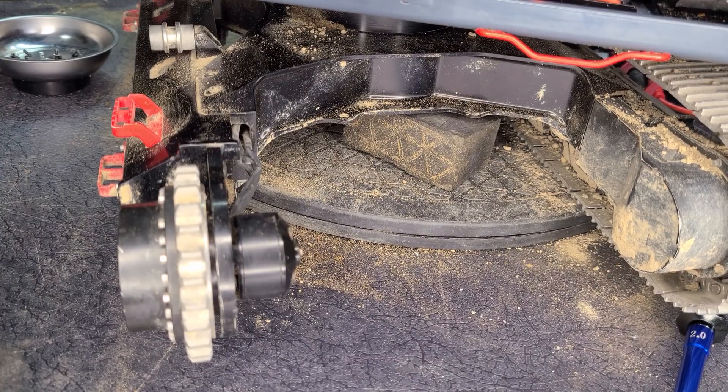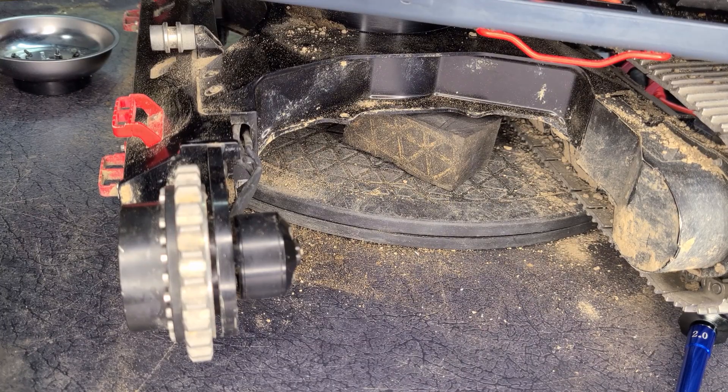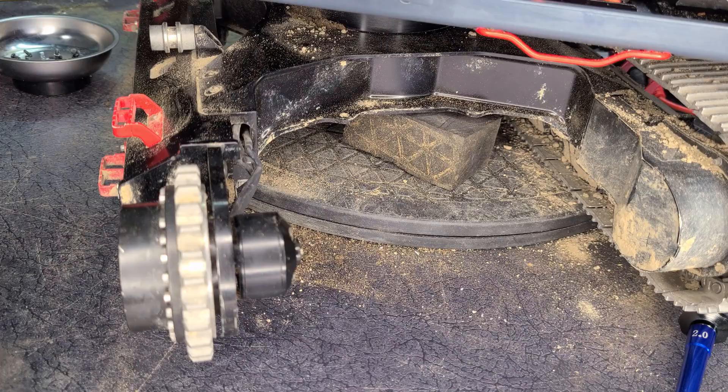I have all the gears out. Let me power up the transmitter — excavator is on. The motor works, but it's not turning correctly. So I'm going to swap out two of these wires because I believe the problem is the phasing of the motor is not correct. I didn't think about that before I took the whole gear assembly apart.